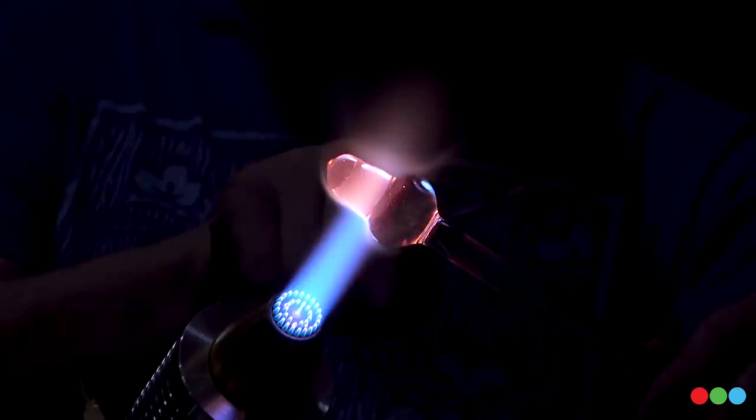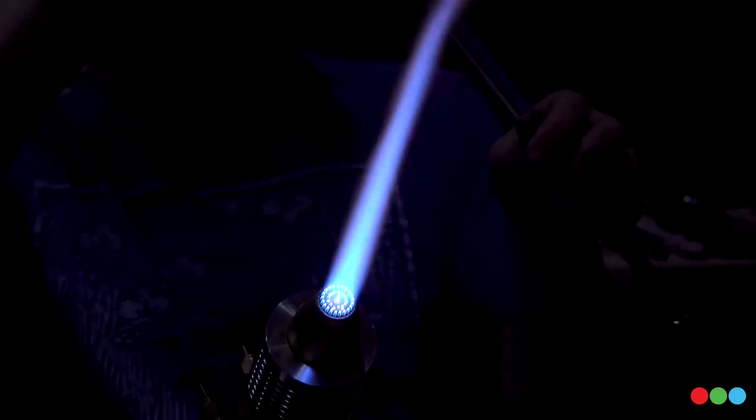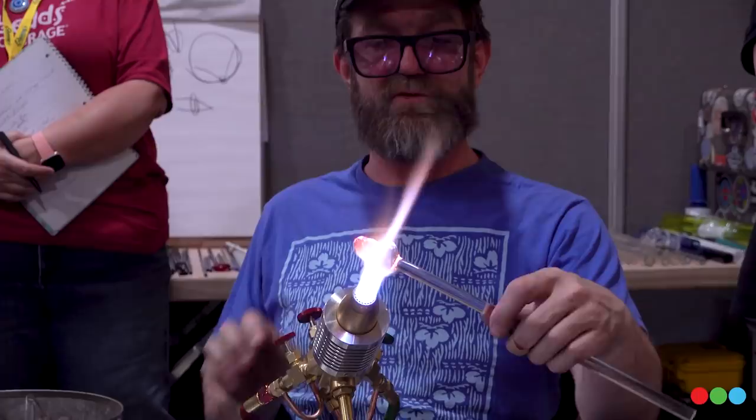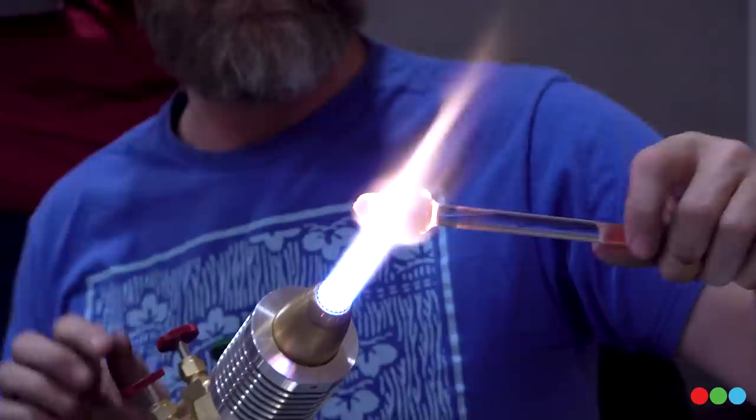Notice the angle I'm holding the glass right now — I'm totally shielding this area so it's not going to get floppy and away from me. I can't come in from the back and let this lens thing fold on me. I've got to move my torch. I've got to react to the glass. I'm hitting right where the lens begins and the dichroic plug begins or ends.